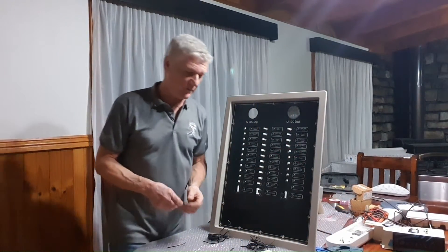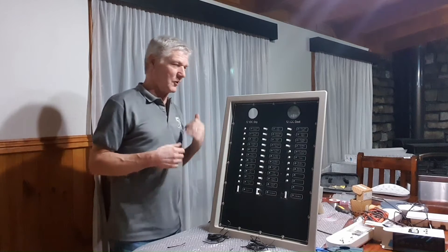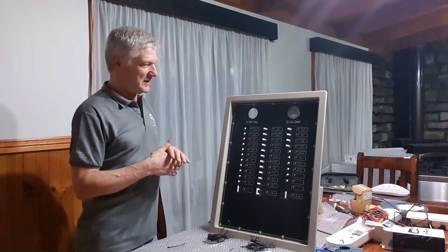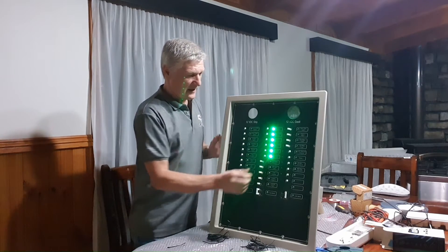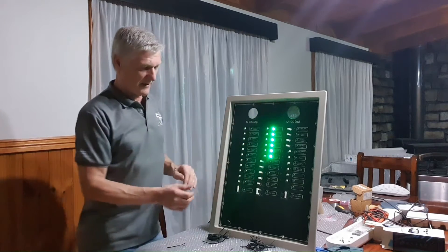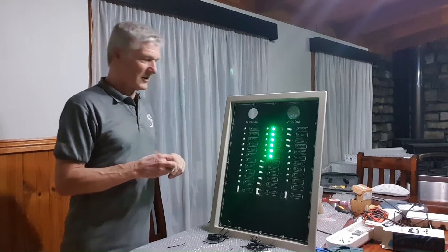As you would have seen, I've been spending time wiring up the DC panel — things that you do when you're not out in the main workshop. We wired up the DC panel and then started to run a few tests. One of the things we found was that the LEDs we purchased for the breaker lights are way too bright. These things are super intense and actually blinding. In the middle of the night during a passage, these would be just way too bright and take away your night vision.